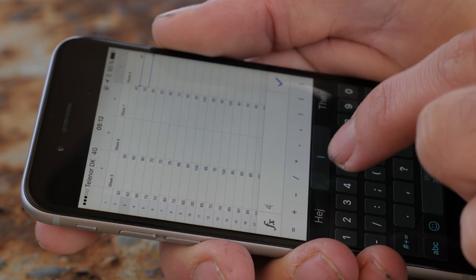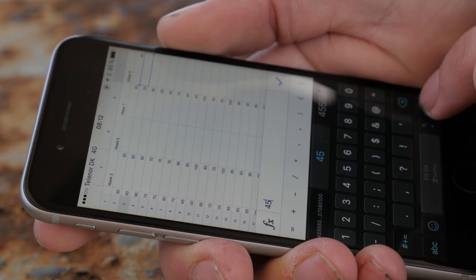I enter all of the measurements into a little spreadsheet — so that's 45. I've grabbed all the measurements, but I think this meter might be quite heavily influenced by the temperature of the laminate, because according to the measurements I've just grabbed, the hull has dried out as much in the past week as it did in the last eight weeks. I don't think that's right. We'll grab some measurements a little later today when the hull has had a chance to warm up — it is about 10 or 15 degrees colder this morning than the last time I grabbed some measurements.